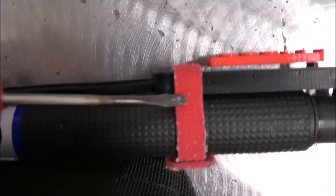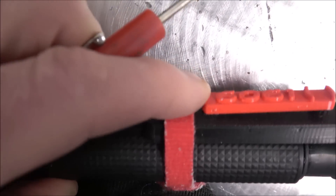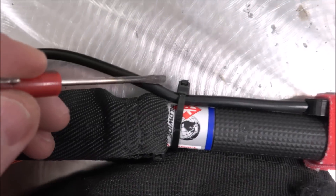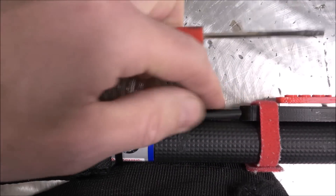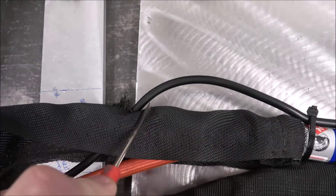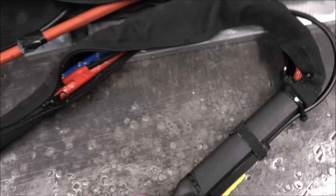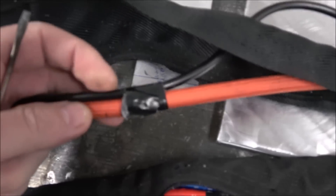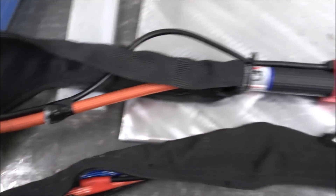Put your Velcro just behind the minimum setting on the slider. Put a zip tie here at the very end so it's not pulling this wire around and fatiguing it right at the joint. Leave plenty of slack here so if you have to curl your torch over like this, it does not bind. And then tape it off to your torch lead down here so it doesn't slide.